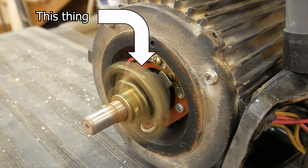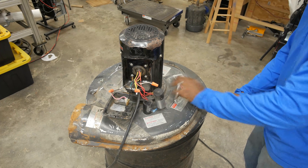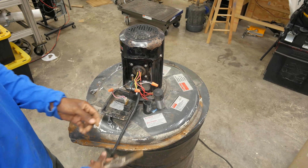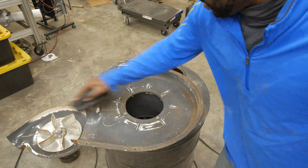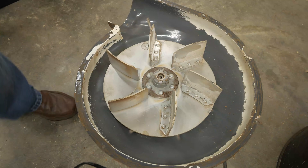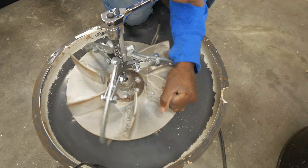First, we've got to get the motor starting properly. It turns out the problem was actually the centrifugal switch. I've never had a problem like that before with the motor, so I've decided to post a video about that separately so that I don't have this motor repair tip buried in a dust collection video. Anyway, I got the centrifugal switch working, and now it's time to clean this guy up and get it into good shape. I bought this thing at an industrial auction a couple years ago and never quite finished cleaning it up and fixing it up.